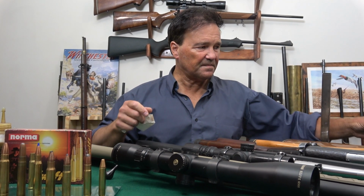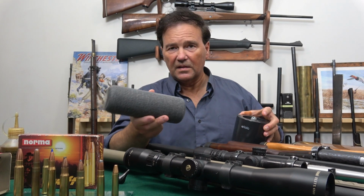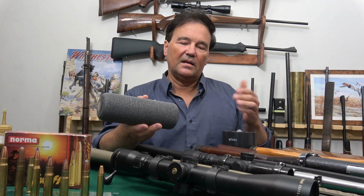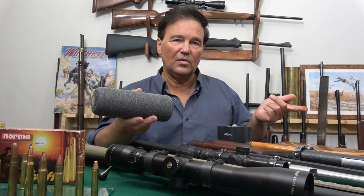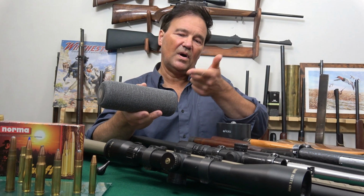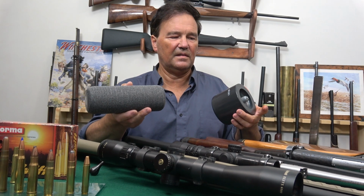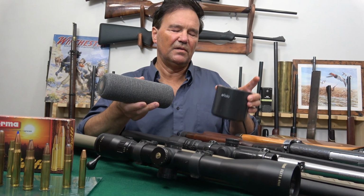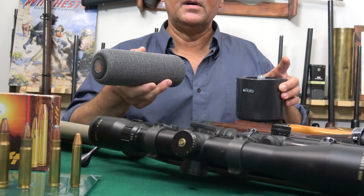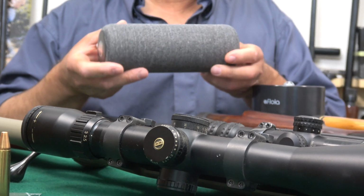So then I did the same thing with the desiccant in there, and the water, and the same vise. And magically, no surface rust forms on the steel. These things are available. I'm sure you can find them, but it works very well, and I like that it dries out. And one can buy silicon dioxide beads as well, but what's nice is that it's all integrated.